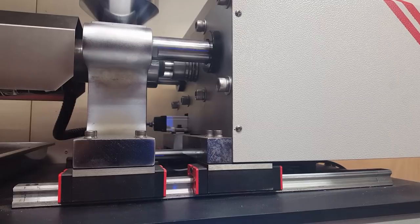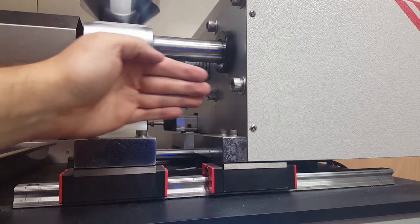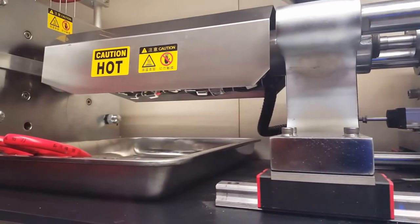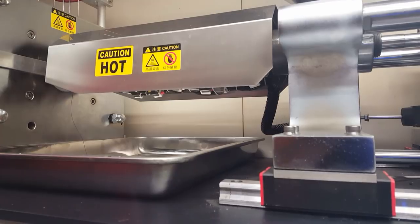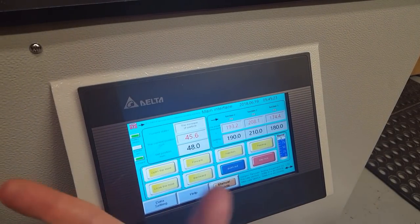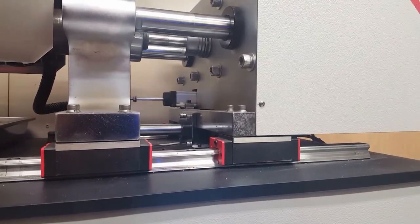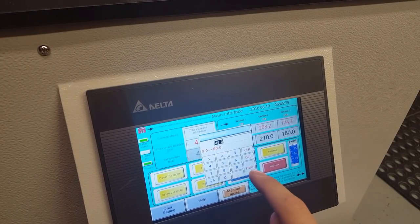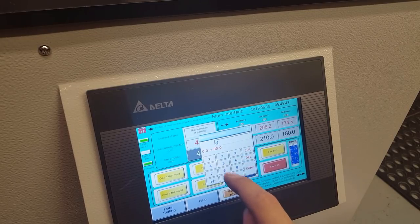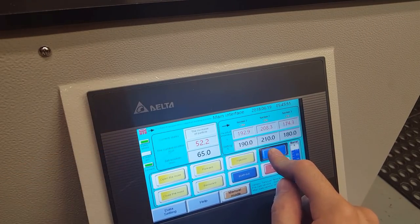So, I'm gonna start feeding it. And you can see right here, the whole screw is pushing the machine backwards right now. And in front of the screw, plastic is piling up almost like an injection shot. This is what they talk about for shot size right here. On the control surface, you can set how many millimeters of shot size you want to use. It uses this actuator here to measure the distance that it's actually filling up. This setting was for two track lengths, but now that I'm trying three, I'm gonna up this. I'm not sure what value to use, so I'm just gonna try something and see what happens here. As I'm feeding more plastic in, you can see that the barrel's moving back.